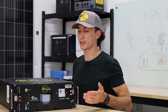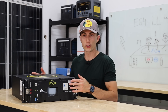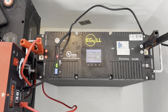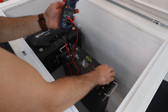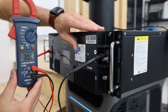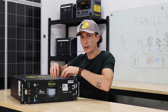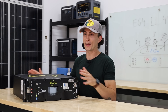There's also a high end on the temperature scale — about 167 degrees Fahrenheit — for if you live somewhere like Arizona. When we turned it on after the freeze test, it threw the alarm light on right away. I connected a battery charger and it just refused to charge — it said 'protecting' and wouldn't accept a charge at all. When we flipped on the breaker and read the voltage at the terminals, there was basically nothing coming out. But the same test with a warm battery reads 52 or 53 volts. That's good news — the temperature sensors deep inside still recognize the temperature and control the battery, because lithium iron phosphate is not supposed to operate when it's cold.